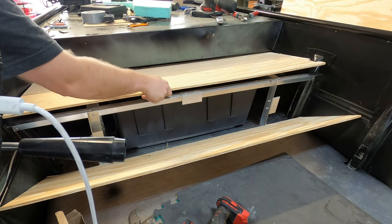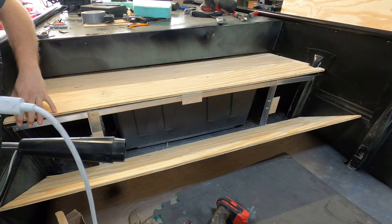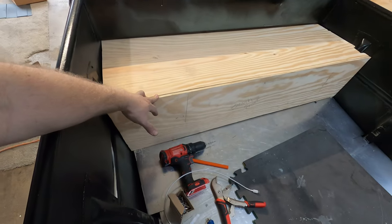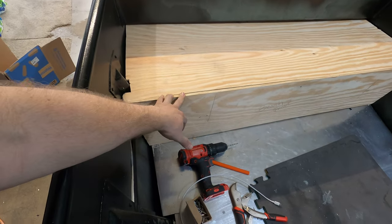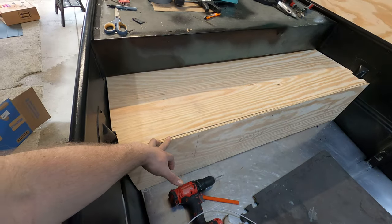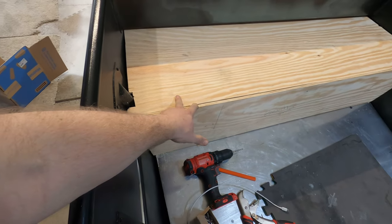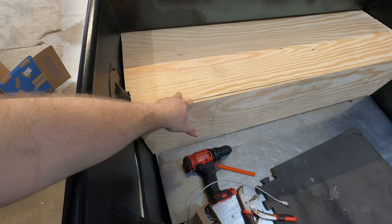Slide it from the top to the ribs flat. Nothing's rubbing. I got a little bit of wiggle room on each side, front and back. That's perfect. At this point I have the top and front paneling for the bench seat cut. I am super happy with how this came out. I did a rough cut, then I used a cardboard template to notch out for the ribs. Then I came back with the orbital sander and touched up any places that were binding slightly on the ribs.